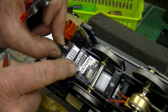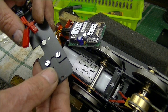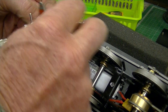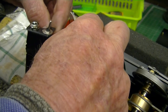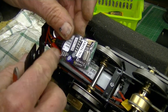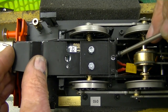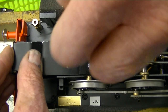The receiver is going to sit here between the frames — beautiful fit. First we've got to plug on the switch frame; it's all male into female. You can plug these plugs onto any of those sets of pins, but make sure the red is in the middle and on the bottom. The switch frame just slides into place, through the hole in the lateral member that you drilled earlier, and you just screw it together with a three millimeter screw.